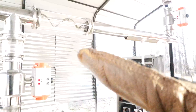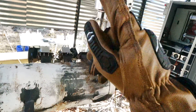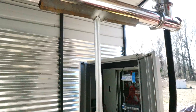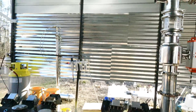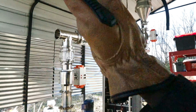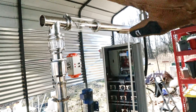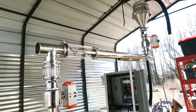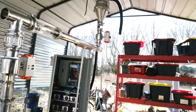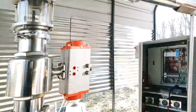This is my microwave. Let's take a look at what being able to load plastic into the machine continuously entails — major efficiency upgrades. This utilizes a double airlock system, similar to what's used in spacecraft. We have a double valve airlock system, and there will be a vacuum pulled in this chamber section that will let us load plastic in, get all the oxygen and air out, and then load plastic into the actual machine itself.